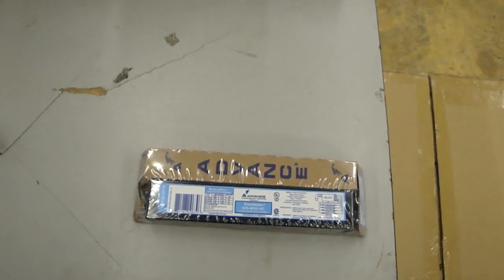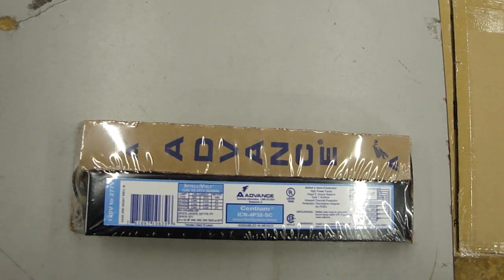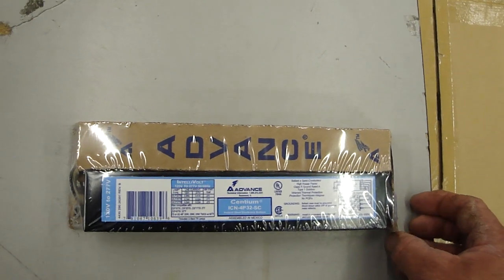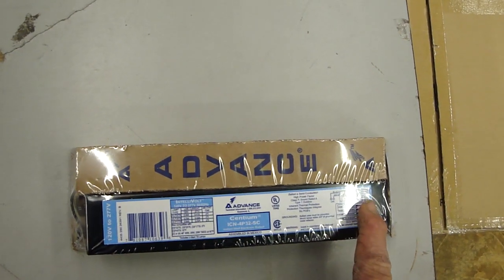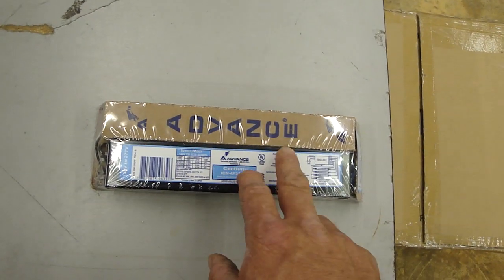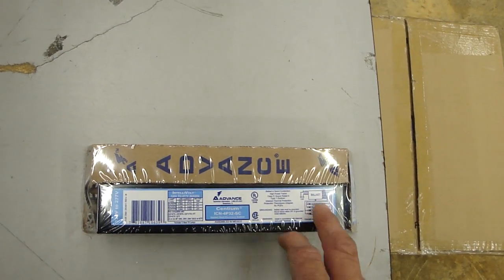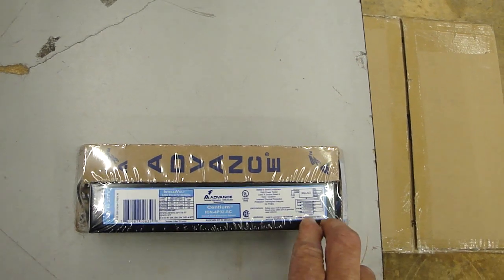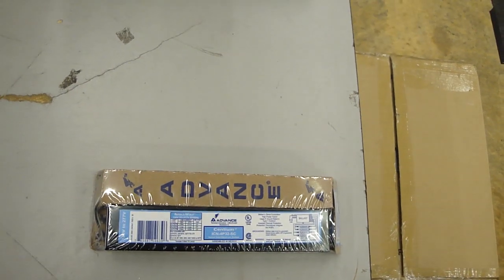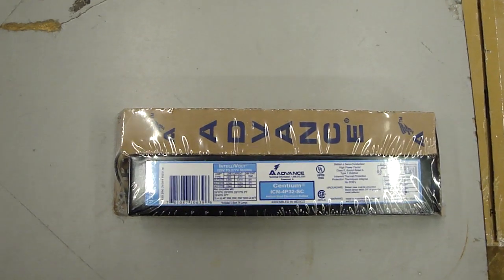And there's a universal ballast unit. I don't believe it's this one, where you could just wire cap all of the blue ones together and red wires together, the secondaries, you know, and the yellow wires together, and have one wire from the ballast unit and cap them all in one. You can use all four from this one, or two for each, and cap them as long as they're color coded. But it works much better if you just do one wire at a time, all the secondaries first and then the mains last thing you do, and you'll have no problems mounting this unit or making this unit work.